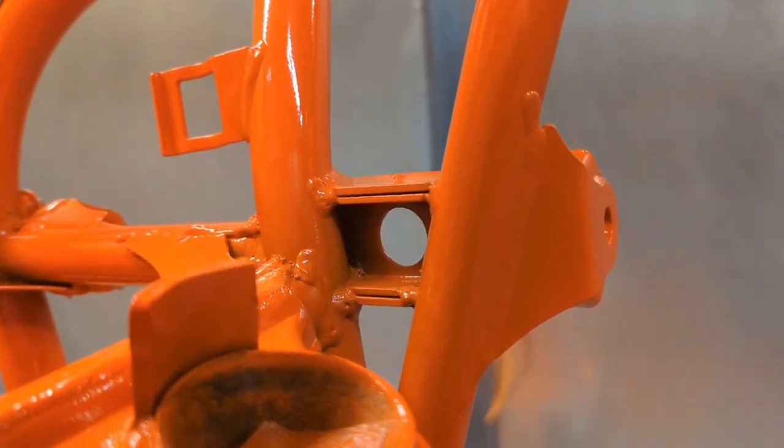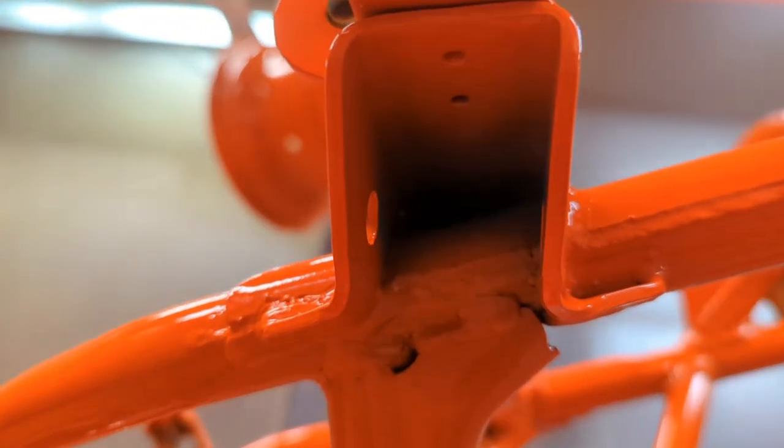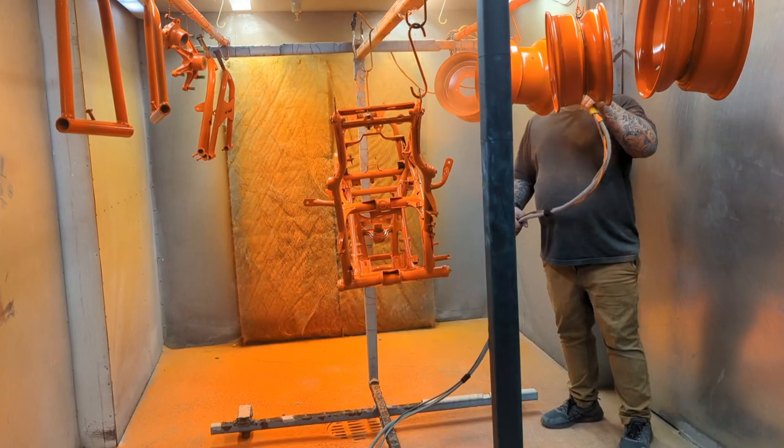You'll see me go over this with a second coat. I end up shooting most of those missed areas first to make sure I get good coverage, and then I go back and spray the whole thing as though I hadn't already coated those areas.